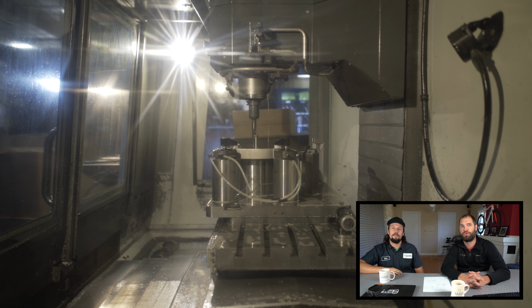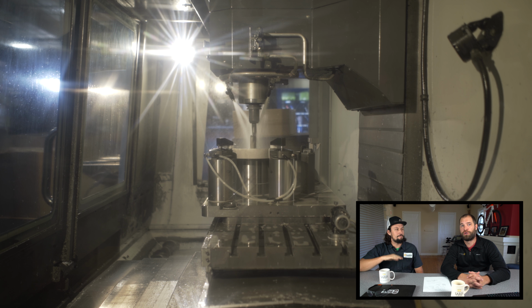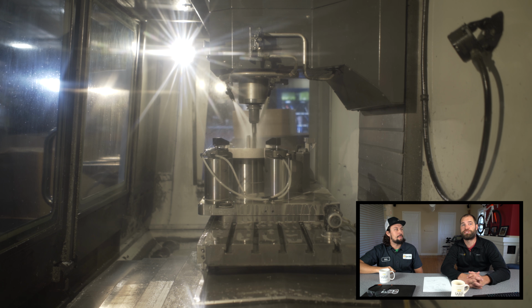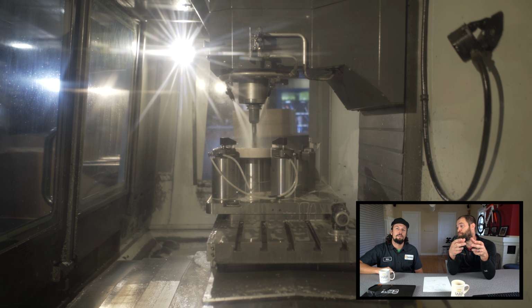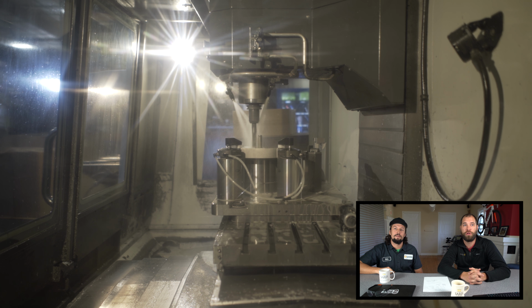So now we're going to clean up the outside of that bearing face, which is going to stay perfectly concentric with that axle. So we're making that bearing face concentric with the axle, and what's going to go there is the bearing and the large pulley. Yep, your large drive pulley. For the belt. Okay, cool.